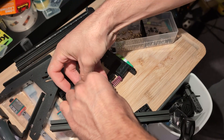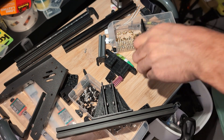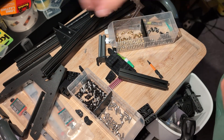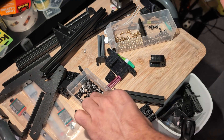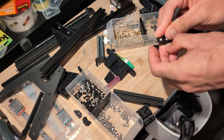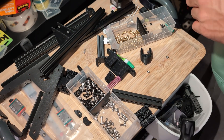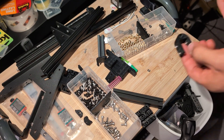Tilt adjust is more about the bed being relatively flat overall, while bed mesh looks at specific points. And this bed is only 120 millimeters, so with tramming I'm not sure if bed mesh will be entirely necessary. I'll do some tests and see how flat my bed is and go based on that.